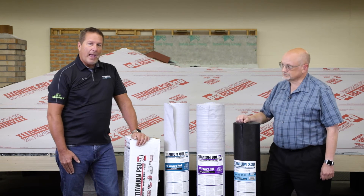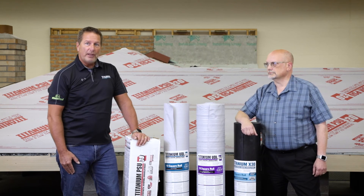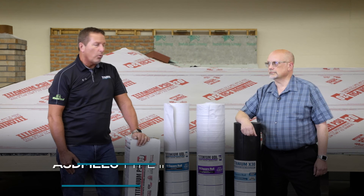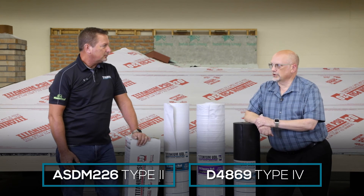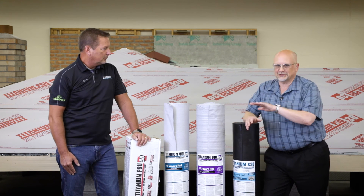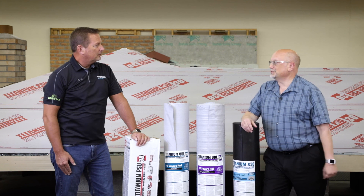The other option is a four-inch seam tape on the joints of the deck, and then you can install an approved synthetic or felt underlayment over top of that in a single layer. The last option is a double layer of synthetic or felt underlayment complying with the Florida Building Code. The felts have to be tested in accordance with ASTM D226 Type 2 or D4869 Type 4. If you're using a self-adhering underlayment, make sure it's a smooth surface — not sanded or granulated — because with expansion and contraction, the panels rubbing against it could abrade the back of the metal, potentially scratching through the galvanization or Galvalume coating and causing problems.